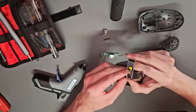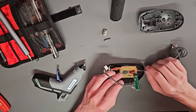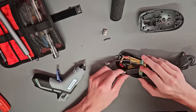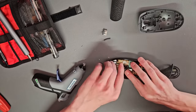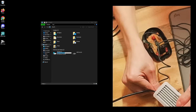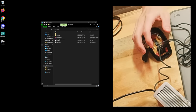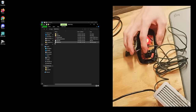I removed the metal shield of the ducky because it only risks shorting stuff out, it saves a little space inside the mouse, and minimizes rattles that would be suspicious for our covert implant. It's going to take some fiddling to get the placement just right. But once it is, you can plug your mouse in — in this case the ducky mass storage pops up because there's no inject.bin loaded — and the mouse works too. And that's how you do it. It's as simple as that.